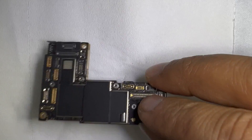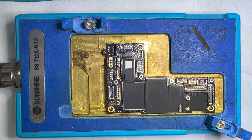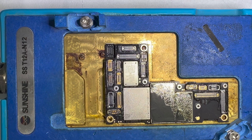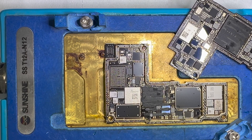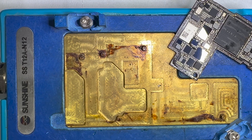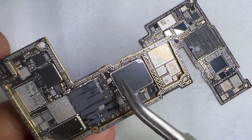I am using a preheater set to 160 degrees and a hot gun from the upper side. We work only with the preheater. Mostly baseband and Wi-Fi related issues appear this way. Let's separate the PCB first. After 2–3 minutes of use this message shows, meaning there is a problem with some ICs.